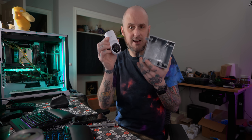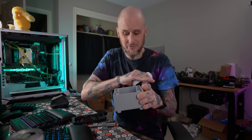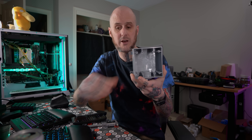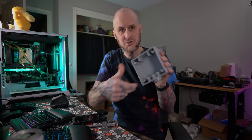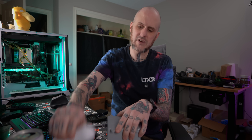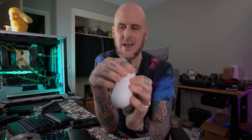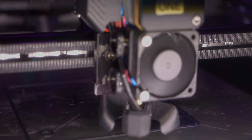As far as the conduit box and the G5 Flex camera that I need to put onto it — I need to mount it hanging down from the ceiling. So again, a fairly flat flange is going to work for me, but I wasn't able to find a 3D model of this box. Luckily, it's just a square box. I can measure its outer dimensions and measure from those outside dimensions to where the mounting holes are, lay out my hole pattern, and then I just need a circle in the middle for where this mounts and a couple of screw holes. I did have to do a little bit of measuring to get the base shape of the G5 Flex, and because the screws are not centered on the circle in the body base, I had to measure an offset as to where they're located. I will likely do a quick test print to make sure I got those dimensions right before going with my final design.